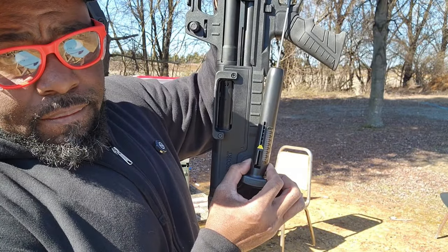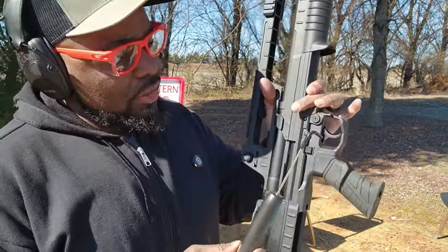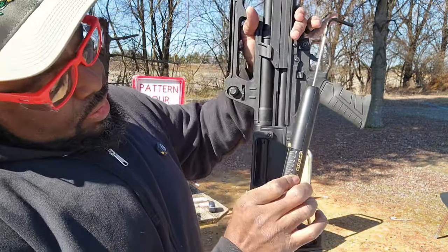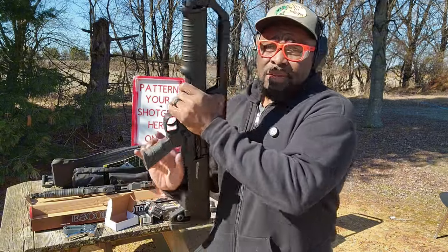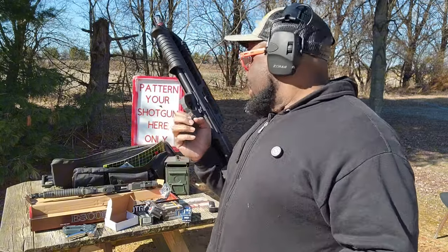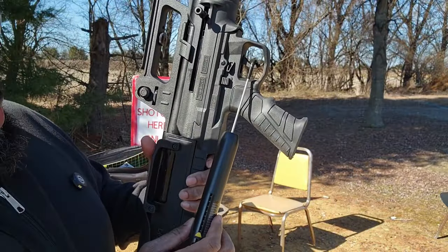We'll do one more — that one broke at four and a half. I feel like the hook was high up on the trigger, which probably added weight. We're going to get that closer to the end and try again. One more time — it's really light, three and a half pounds. So a three and a half pound trigger on the pump action — very light. My precision rifle is about two and a half to three pounds. Very smooth trigger, no crunchiness, no grittiness. Now let's take a quick look at the semi-automatic version's trigger.